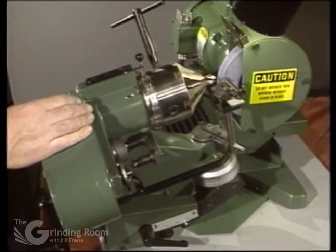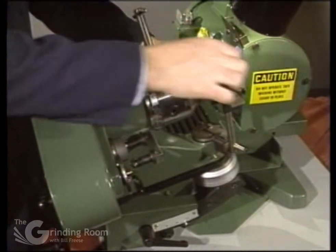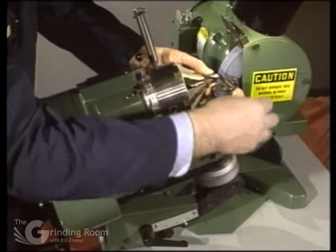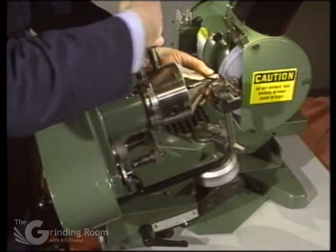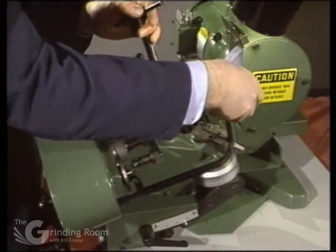It's very similar in setup to the point splitting. What you want to do is then set your end stop out, push the drill against it, rotate your lip on the gauge, tighten it up, and pull the blades back.